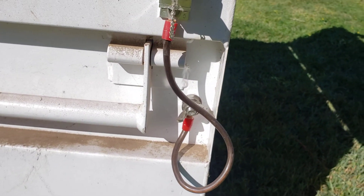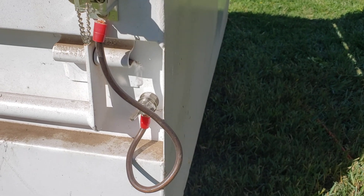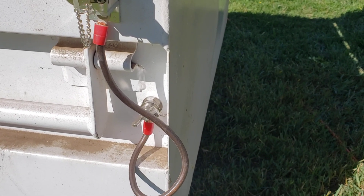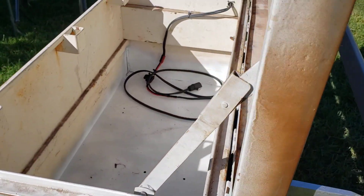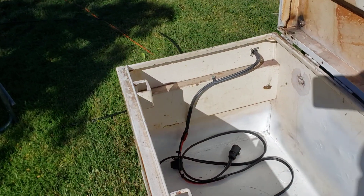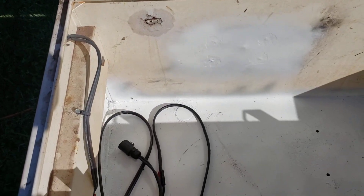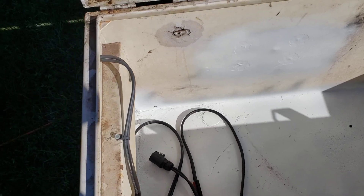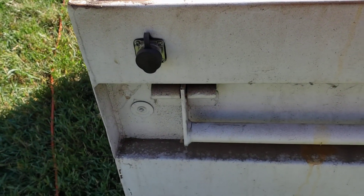There's an 8-gauge cable that goes down to a grounding lug, so you tie a ground wire into that, hammer an 8-foot copper rod straight into the ground, and the whole box is thoroughly grounded. On the other side is the solar charge cable — you want solar coming out of the side of your box using the same connectors that are on the portable repeater.